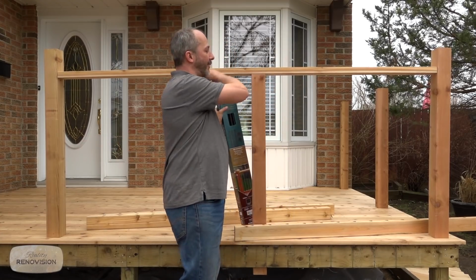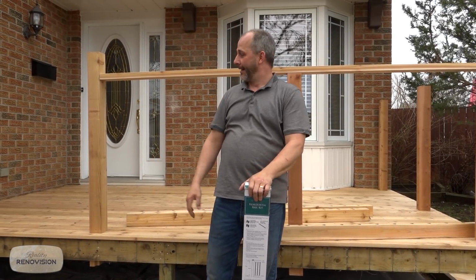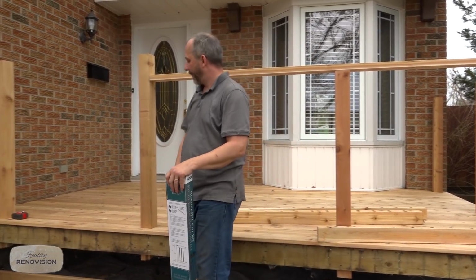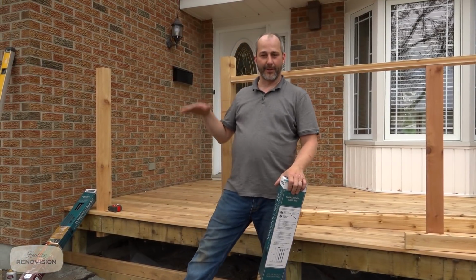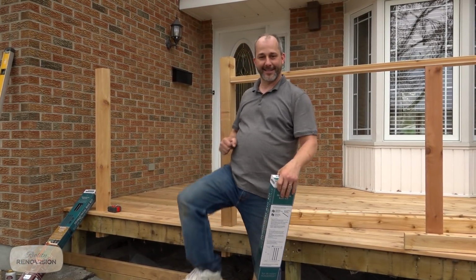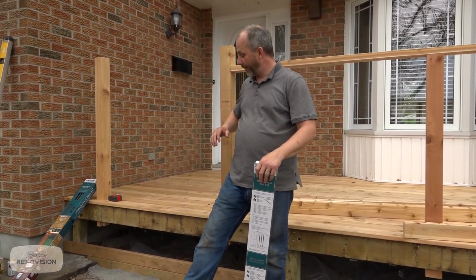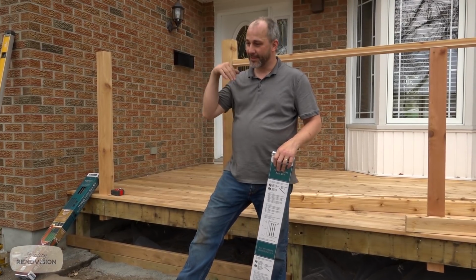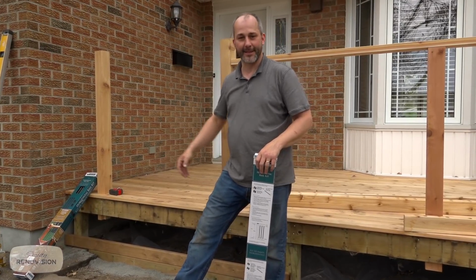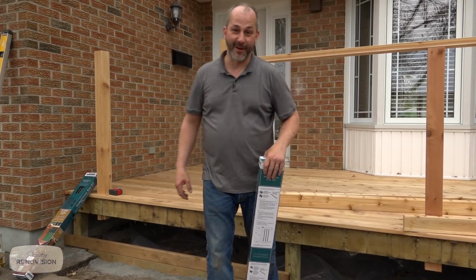We're gonna finish this whole system over to the stairs and down our 2 steps onto the regular landing. And we're gonna do these really gradual because when you get visitors to the house, it's nice to consider the fact that grandma is only 5 feet tall and she just can't high step it like she used to. So instead of going with a 9.5-inch stair, we're gonna go with 3 steps here with a 6-inch rise. And that'll be simple to build. We're just gonna use 2x6 and make a couple of boxes, tie it together so no one slips, and voila, we're gonna have ourselves a finished project.